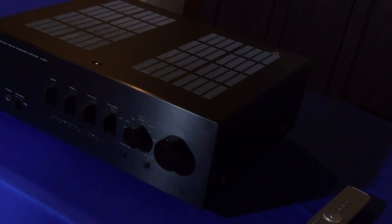It does SACD in its native format, the DSD, all the way up to the 5 megahertz range. It does 384 kilohertz sampling rate of PCM. Not that you're ever going to get anything big above 192, but the point is it supports every high-res format in its native form. Doesn't downsample, doesn't truncate or anything like that. This is a high-end DAC, folks. So like you said, you plug it right in to your computer and you're in heaven. Absolutely. Holy cow, this is amazing.